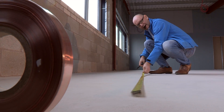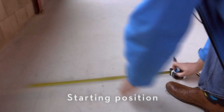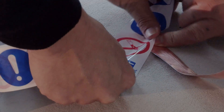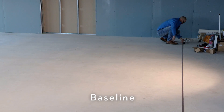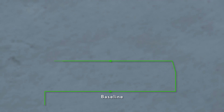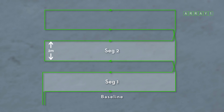We need to identify our starting position which is usually a metre in from the corner where you want to start. We then run the first run of cable which is called the baseline, laid along the long side of the room as we see here. We then show a two metre wide section of loop which is this first rectangle. Next we've got 3.2 metre spacings which is where the next two metre rectangle starts, and then a third rectangle of two metres which is again 3.2 metres away from the previous one.